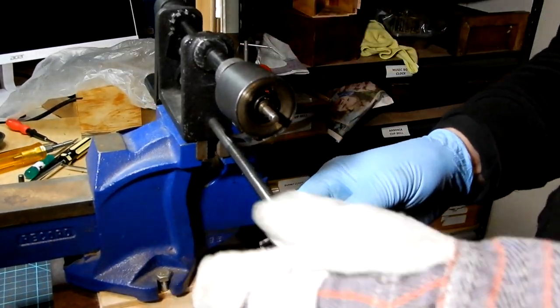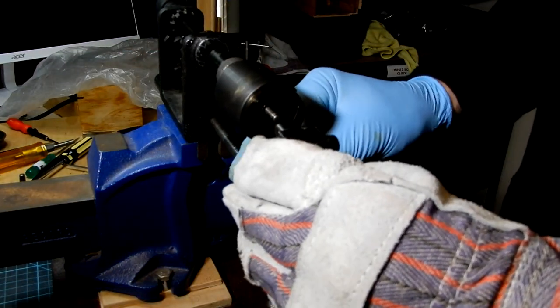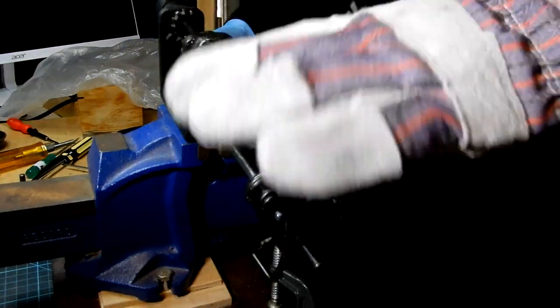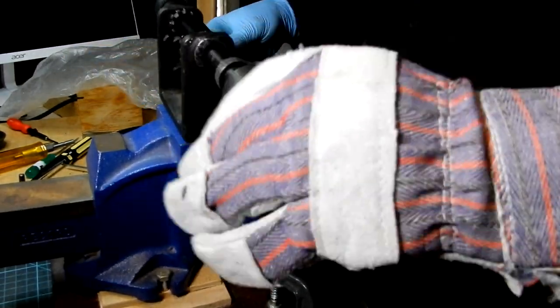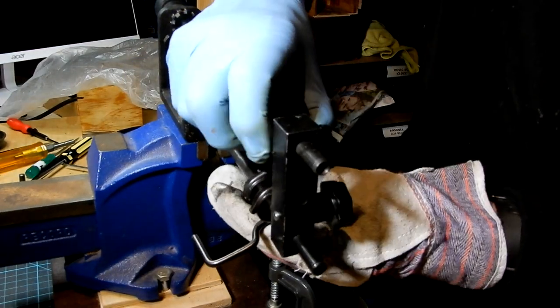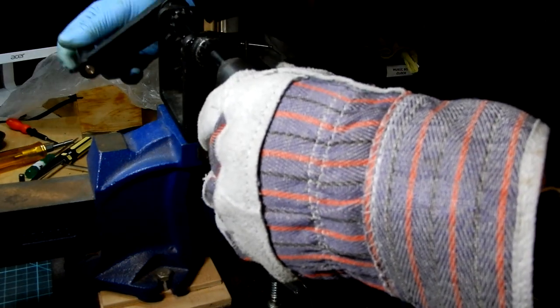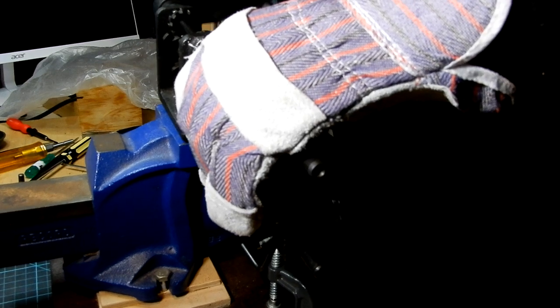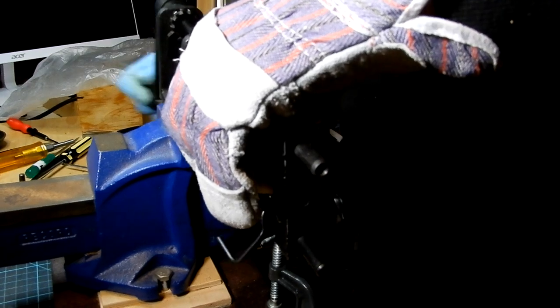Okay, spring back into the winder. Tighten it down, put the arm on it, then wind the spring up again. Slipping around until it gets tight enough so you can slide the sleeve off. Reverse the flow of the wind up. Put your hand over the spring and unwind it slowly.